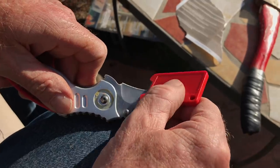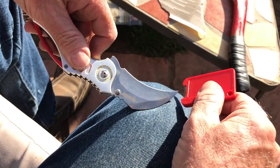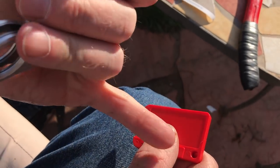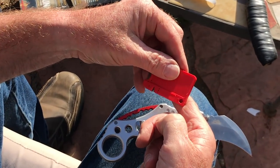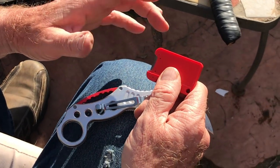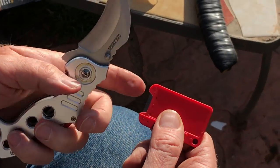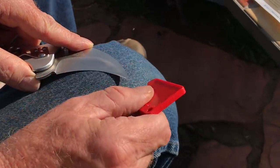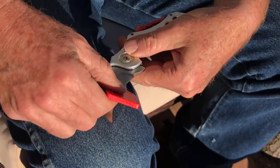I'm going to go ahead and let my leg be the support here. And then go right on around the radius, right off the point of the blade, just like that. Turn it over and do the same thing. Again, for the back of the rectangle, it's in the second knuckle right there, in that crease. And just like this, not like this right straight out, but kind of with the corner of it like that. That puts this at the correct angle to use it easily right on around that radius and right there off the point of the knife, just like that. Turn it over. You can come back this way if you choose to. That's okay too. You can go out there.